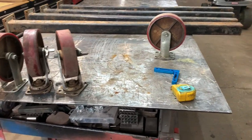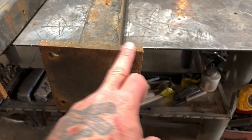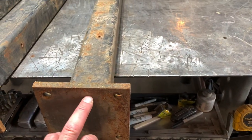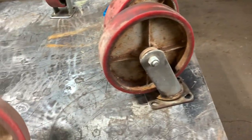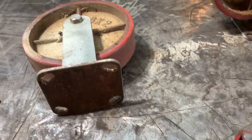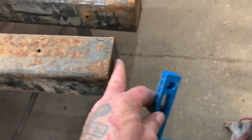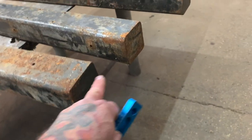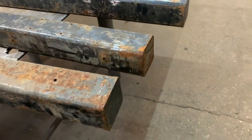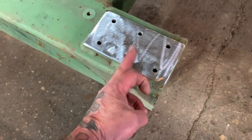It's the next morning and I'm messing around with this. I was looking at these pads on the bottom — this is a six-inch by six-inch square pad. I'm just going to weld them on rather than bolt them. I checked these with my machinist square and they're square here and here, both ways. Whoever capped these off did a really good job — all four of them are completely square, which means the legs will sit nice and square off of here.